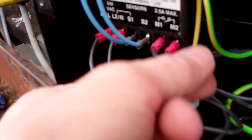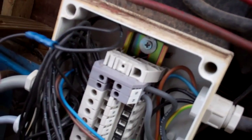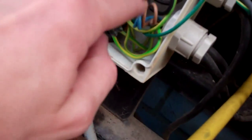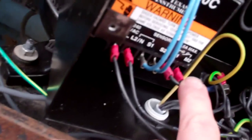Look for the module wired in - live and neutral, switch wires. That cable goes back to that little mess there, which is as it was originally. We haven't really changed it, just joined this in because that's an extra - just put it on circuit with the LP switch. Permanent live off of that wire, neutral off of the fans, and we just put the switch wires in the circuit with the pressure switch.